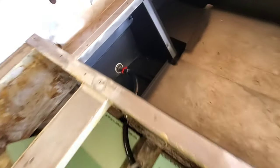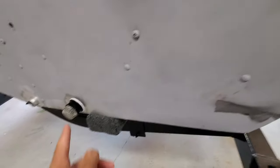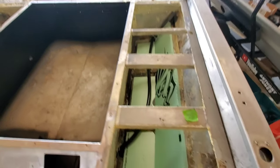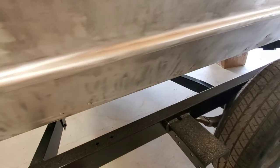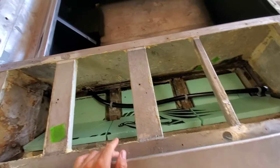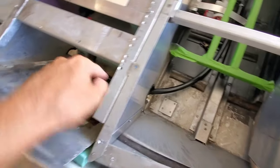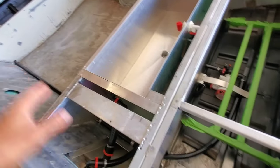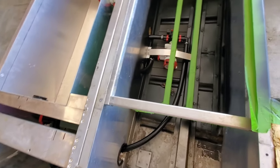Here's the kicker — this pump is not going to suck water. I've mounted the inlet very low on the transom, and I'm hoping when we get to the water the waterline will be right up around that fitting. The way this hose is routed — the only good route I could manage since I couldn't get it under the floor — keeps it below the waterline. When the boat goes in the water, this hose will fill up with water, water will fill that air cavity, and then flow downhill back to the pump. Once there are no air pockets, the pump should maintain suction and fill the livewell.